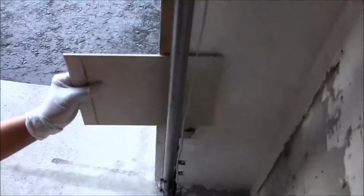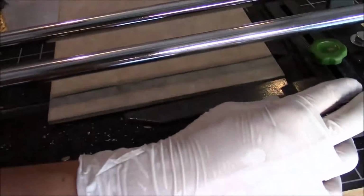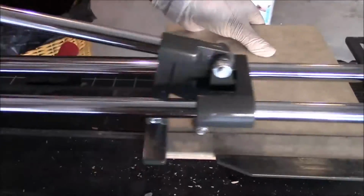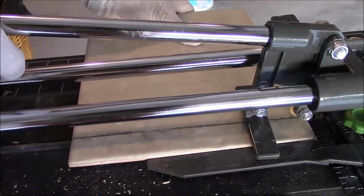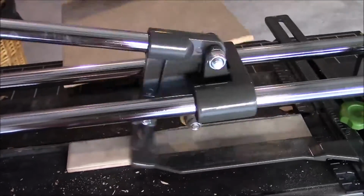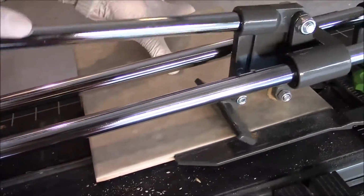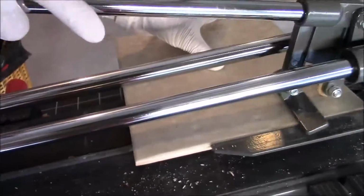First, measure the tiles and cut them for the spots where you need to cut the tiles before installation. Before starting to cut the tiles, check the manufacturer's instructions for your tile cutter and make sure that you follow the safety instructions. Check and make sure the depth of your trowel notch is the right size for your tile.